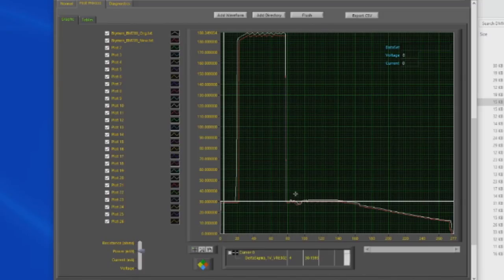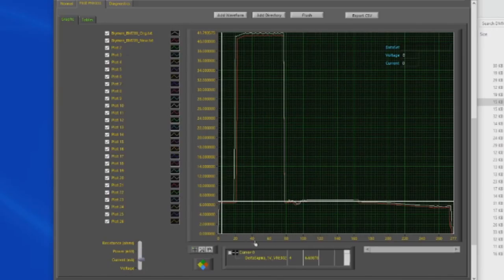Down here we can see where we're going through the different modes of the meter. Just go ahead and select current. So about 42 milliamps or so of current draw with the backlight on, and the average is about 6 or so milliamps. Down here you can see as I'm ramping the voltage down, the current eventually just drops off, and that's where the meter turns off.